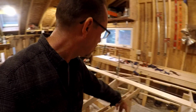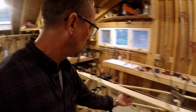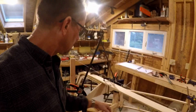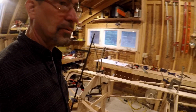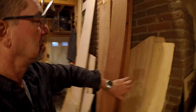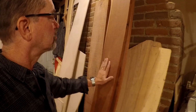That'll go back here. And then a strengthener piece of sapelli that runs from R1 to R2 that just becomes something especially to build on for the forces of the mast step that sits on top of that up against this rib. So we need some sapelli just to get started with that. We'll have to buy more. Although this guy will probably make a couple of the thwarts. We'll see how it goes. I'm going to try to take the smaller pieces out of this 1x6.